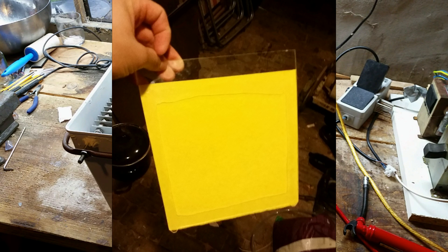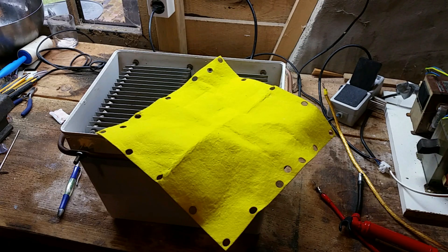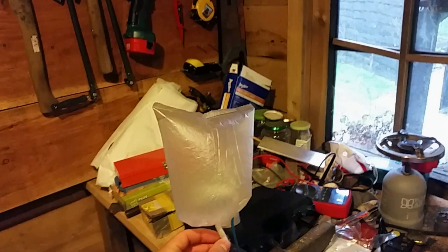But what I already did with this generator was separating the two gases. I did this by gluing a frame in between the anode and the cathode, and attaching a piece of kitchen towel — a kind of synthetic felt. When this felt is wet, the surface tension between the fibers prevents gas from flowing through, but it conducts electricity without any measurable resistance. That's how I could separate the hydrogen from the oxygen, and that's how I filled my first little hydrogen balloon.